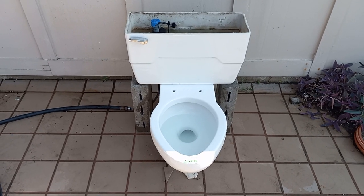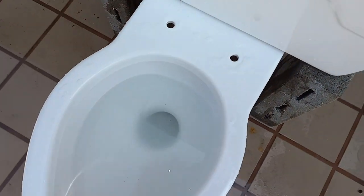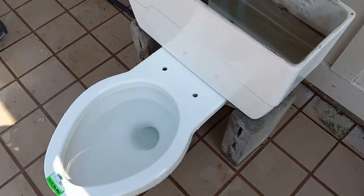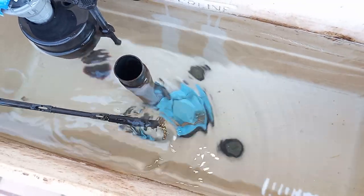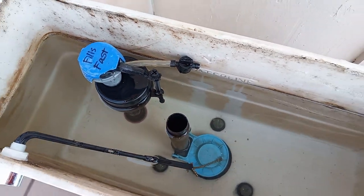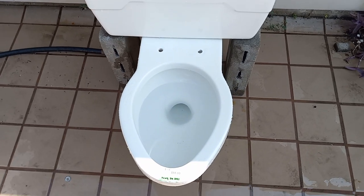Here are the tests on my 1984 Kohler Cayuga. I have it set to the water line and it's on a universal flapper that's probably similar enough to the original for the test to be accurate. I have it on this fill valve that usually fills fast, except it's filling a swimming pool instead of a normal tank, so it is actually pretty slow. But let's give it a flush and see how it does on the tests.